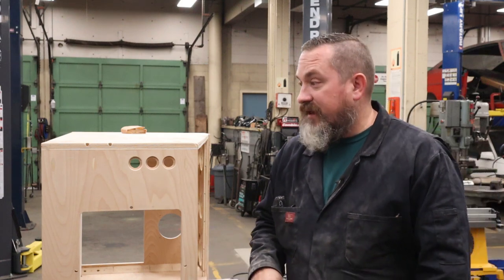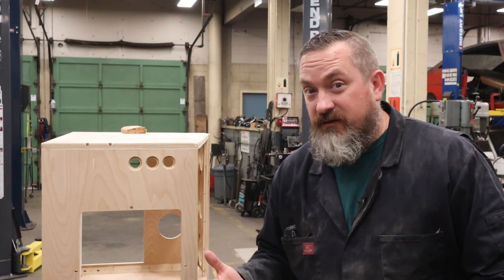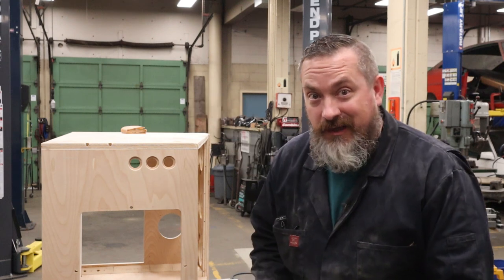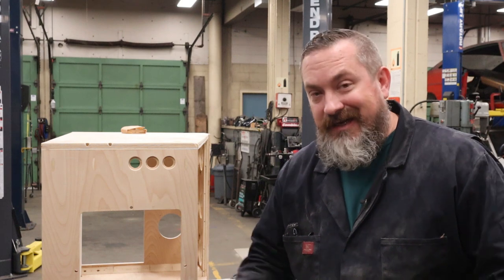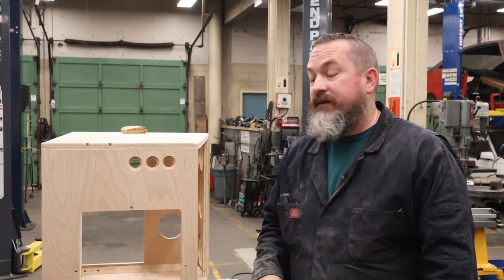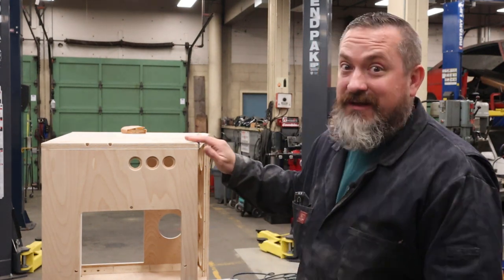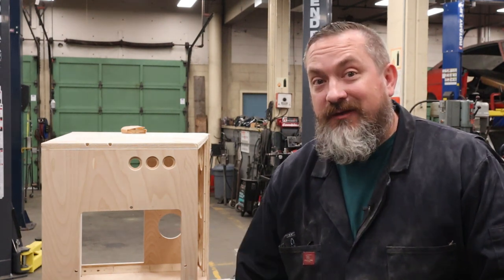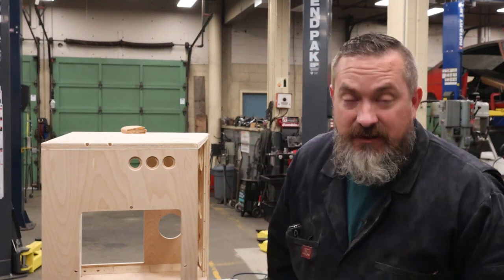So the best option for that is to get a massive tub of wood filler, or you could use automotive body filler like Bondo. You're going to basically treat the external surfaces of your cabinet like a birthday cake and ice this thing completely, try to smooth it out as much as possible, let it dry overnight, and then sand it down completely smooth with probably about 220 grit. But like I said, I have very nice surfaces with this cabinet grade plywood, so that is not needed for me. And to top it all off, in the next video when I show you how to prime and paint this, I'm using a sandable primer that is going to absolutely get rid of anything that's there, so we won't see that.